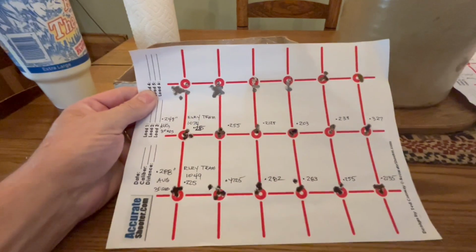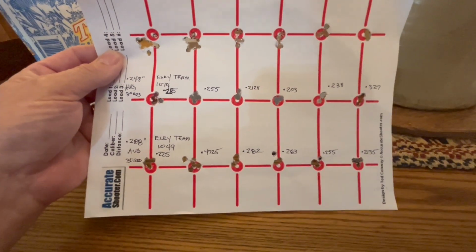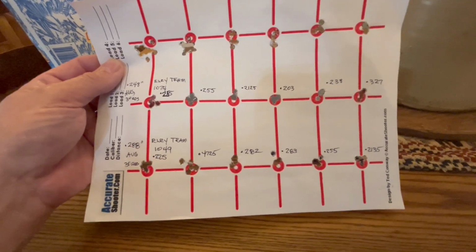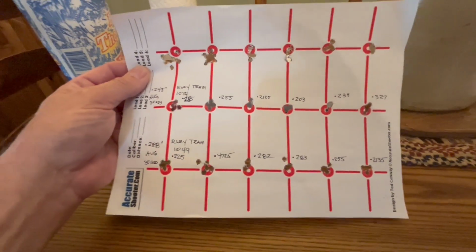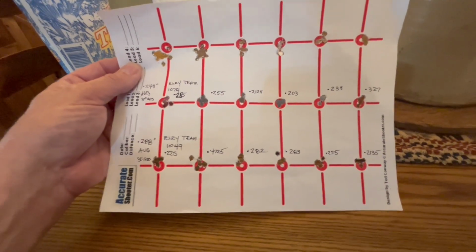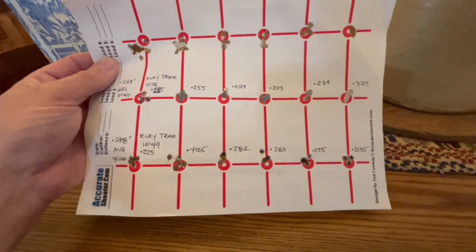Alrighty, this is Lead Fever. Now, my quest for this Ruger Custom Shop 1022 was to get the Ely flat nose bullets, the EPS bullets, to feed. I was having a lot of trouble. Every third or fourth round would jam, and it would smash the nose of the bullet, rendering it useless. I initially shimmed my barrel out 40 thousandths. It did a little better, but it was still jamming, and I figured I had it shimmed out a little too far. So I backed it in half that distance, to 20 thousandths. I have had one jam this whole time, and one magazine issue.